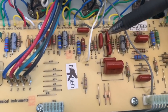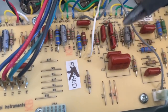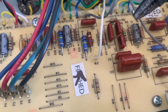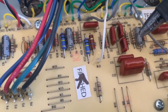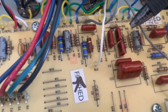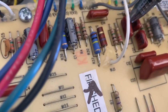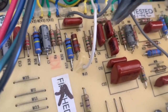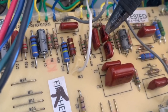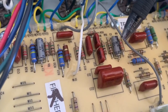The first parts we're going to change are C20 and C21. These caps are all oscillator caps and they control basically the speed of the tremolo — they set the standard for the range of speed that we can get. This cap is already 0.022 and these two are 0.01 microfarad. We want to change these two from 0.01 to 0.022, and that will slow the speed of the oscillation.